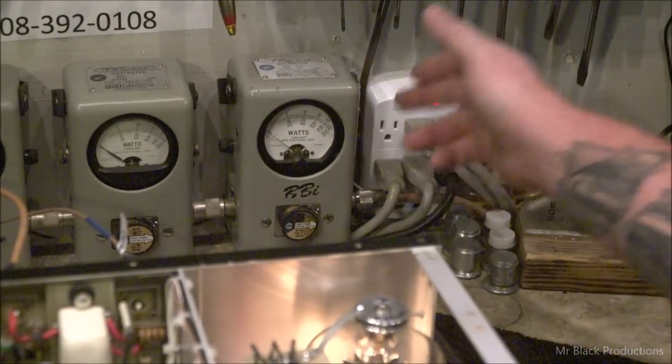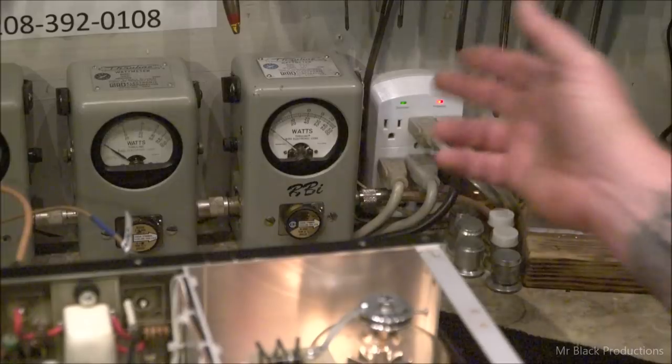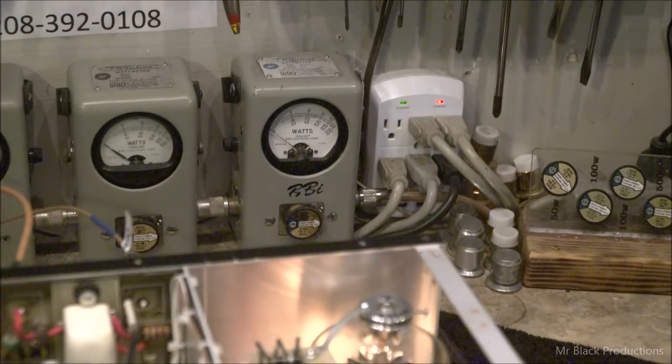Let's go down here to 1X real quick. Okay. About 150 watts worth of drive. We're going to accept the fact that about 220 is about the most that we ever want to do here. Turn my radio off over there. Put this into operate. One, two. 1800-ish with 150-ish watts of drive.